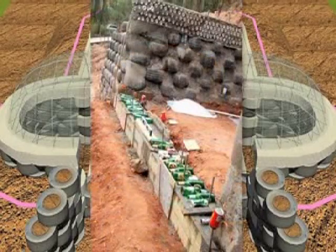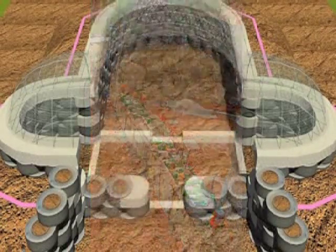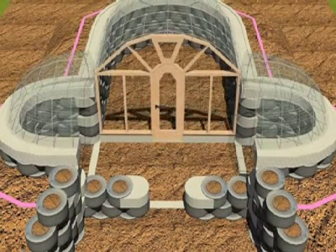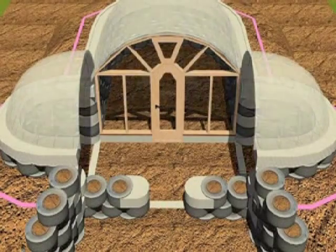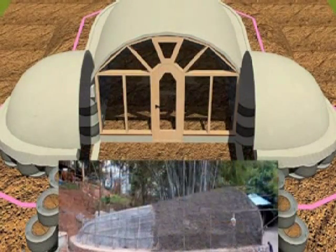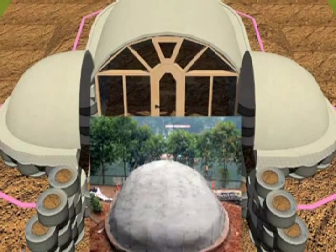It is set up to receive several coats of plaster and be a ferro-cement dome. The little footing across the front will take some framing as per the architectural drawings — non-bearing framing, just filling in for glass and a door. The vaults are then plastered, and the first coat of plaster usually has some fiber in it to keep it from going through the mesh inserted underneath the rebar.